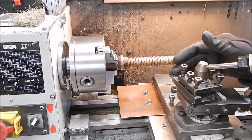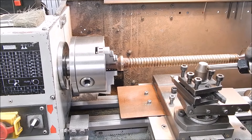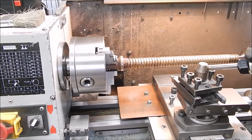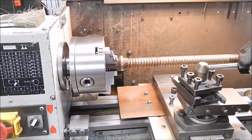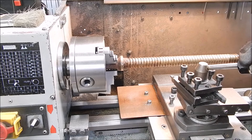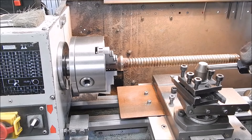To do this we're just going to use a TCMT insert, which is a good insert — very forgiving. It handles most metals pretty well. It's got a good radius on the tip, not too pointy. So it can give a good finish depending on the feed speed, of course. I'll go in on medium feed and spin it at about 600 RPM — let's do it.